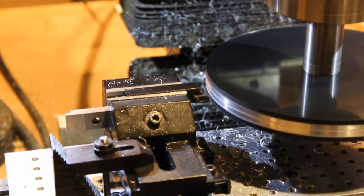I've changed the cutting depth — it's just 1 thou at a pass, which I think will be a lot better. And I've bumped up the spindle to 1,200 RPM.